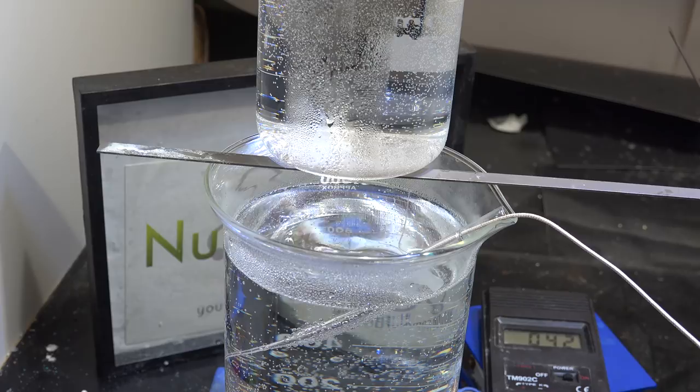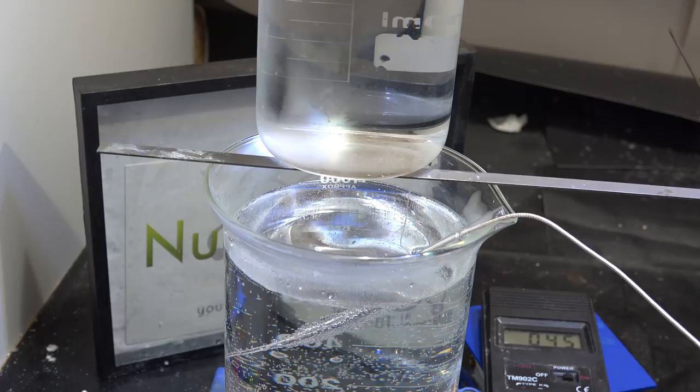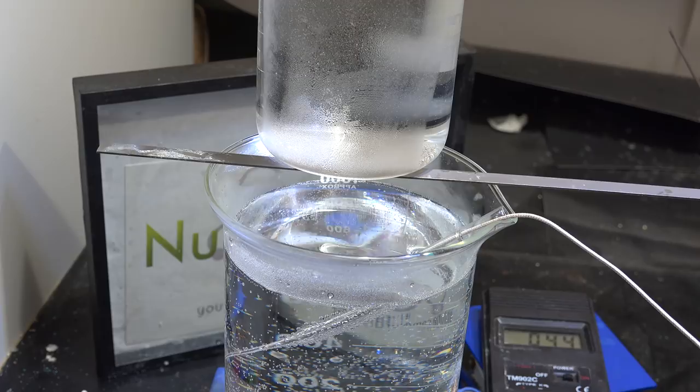But there's one very important consideration when using this effect. The molecules have to be able to travel from the surface of the evaporating liquid to the condenser. In boiling distillation, the vapor pressure of the boiling liquid itself pushes the molecules over, so the distillation apparatus can be large and unwieldy — as long as it's boiling it'll work. It'll push against the atmospheric pressure and reach the condenser. But when you're using evaporation alone you have to rely just on the diffusion of molecules. This can be very slow for large apparatus. What you need is for the molecules to travel as little as possible. You need a short path.